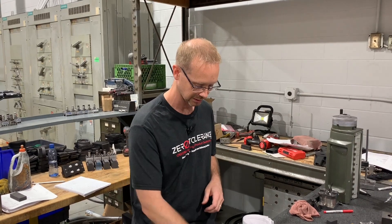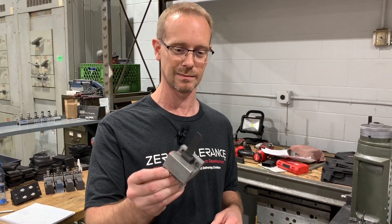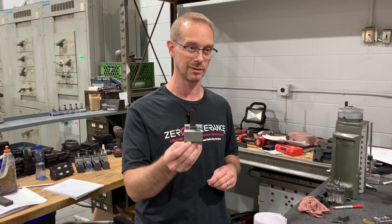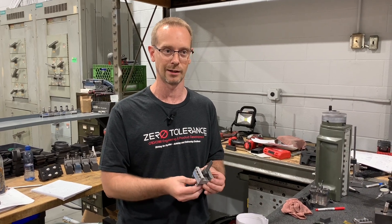We want to combine all three types of EDM in this episode to show you how powerful EDM makes things. When I started off in the trade, there was a lot of inserts being made to create ribs. Ribs are the most common use for injection molding — to put ribs in plastic parts — and burning them is the most efficient way to do it because you cannot reach very tiny areas with cutters. We have electrodes that make features typically two inches deep in hardened production steel, or even aluminum, where there's really no good way to get down in there without rib electrodes.